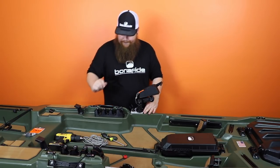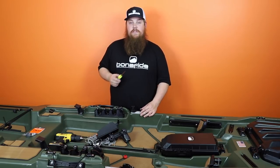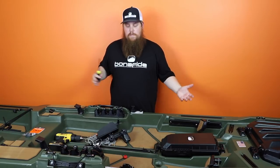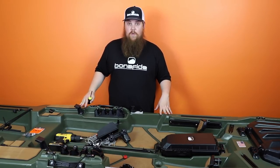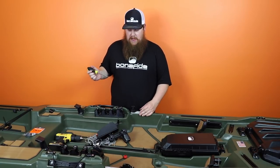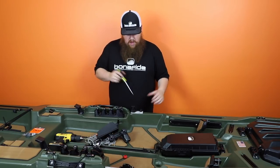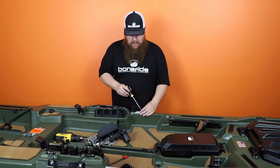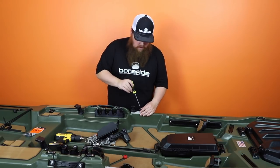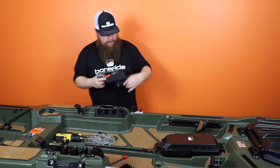After playing with a little bit of configuration with the throttle mount and the reverse lock, and also consulting Jeff, who's had plenty of install time and sea time on the water with his SS127, I'm actually going to reverse the positioning to where I can have the throttle mount be a little bit farther back, out of the way of the cockpit, but also have the eyelet and the hole for the reverse lock on the outside. So I'm going to tighten that up and then we will put the throttle mount back on.